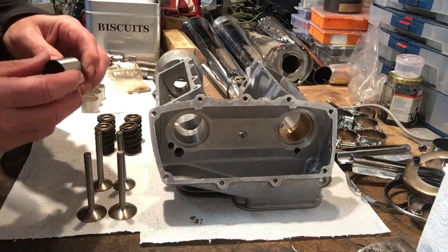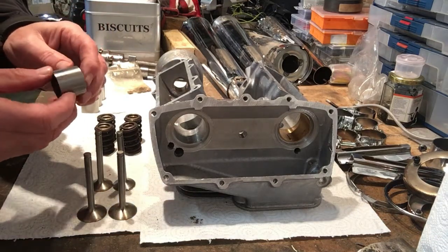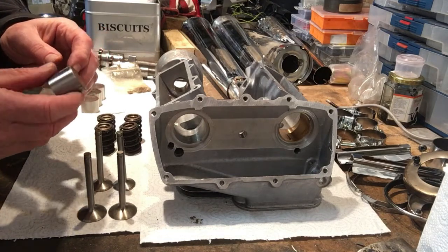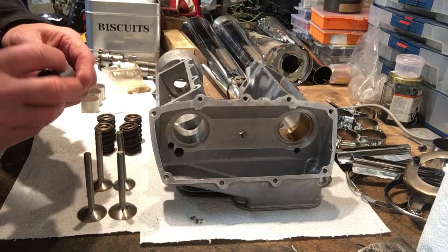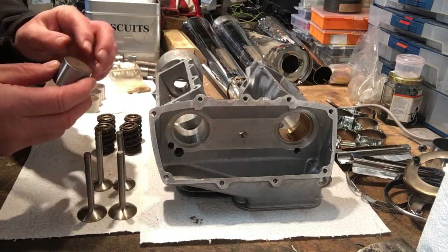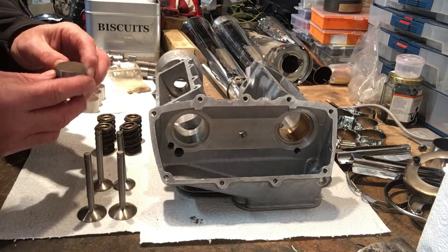we sent these away to the grinders, which is a pretty specialist job in itself, with the drawings, and then they've just ground the outer surface to drawing, but they've not actually ground the top, which should have a very, very slight radius on it.